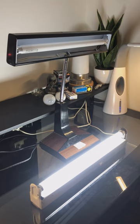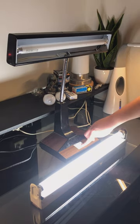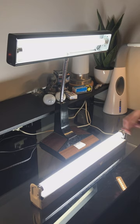Manual preheat, on the other hand, places you in place of the starter. To start a fluorescent lamp on manual preheat, you hold down a momentary contact switch to preheat the filaments for a few seconds, and then let go to initiate the arc.